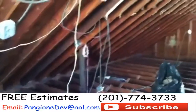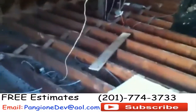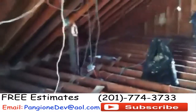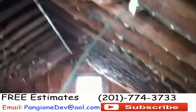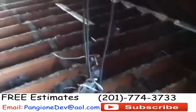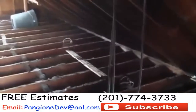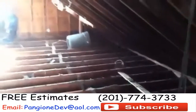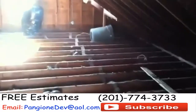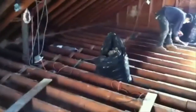They're going to take all these wires that you're seeing here, and anything coming out of the second floor and going up will be removed. You can see all these high wires here, and the floors, you can see the old light switch wires. They're all going to be removed. And I mentioned in an earlier video that we're going to put a 4-box receptacle up here for the framing crew, which will be tied into one of these wires. I'm sure we have 1 or 2 feeds coming up here, so we'll tie in a quad box.